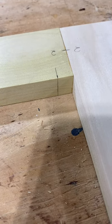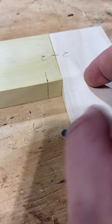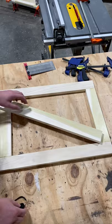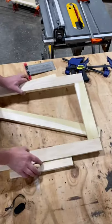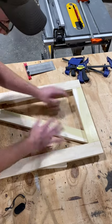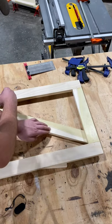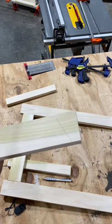Now that both sides are clamped up, you'll see I've drawn lines a half inch in from the side. There are no angles on the X pieces in the plans because if you made any mistakes on the setup you can make up for it to save on gaps. Pick this up, put a board underneath, take some scraps to level it off so it's not rocking, then take your board cut for the X and line it up with the lines in the corners. Then trace the line.